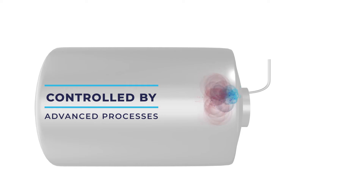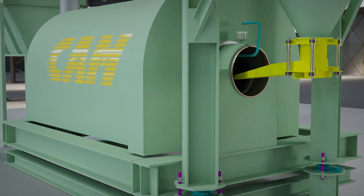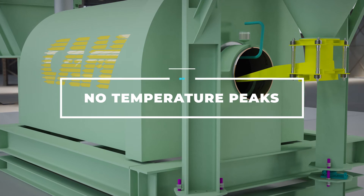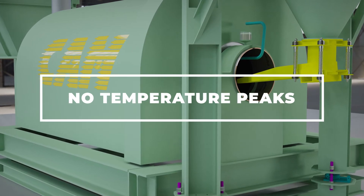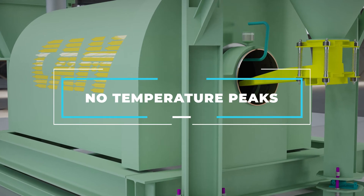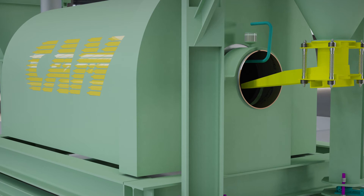These molecules of water are sprayed at a certain pressure inside the mill drum, so as to not permit instantaneous contact with the oxide bed. This is done to control the temperature inside the mill in a direct manner, so that you never have peaks of temperature which could cause the formation of orthorhombic crystals, which are damaging for batteries.